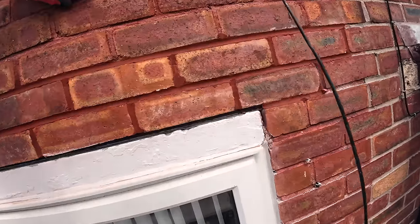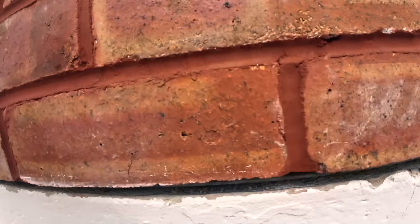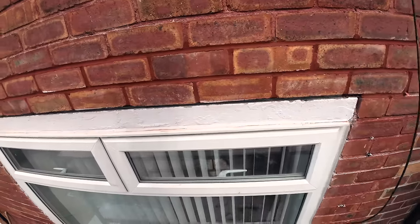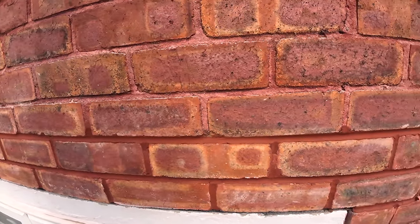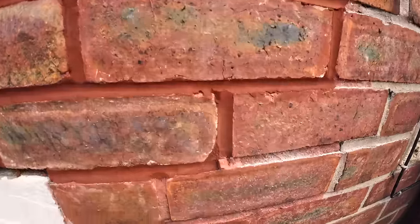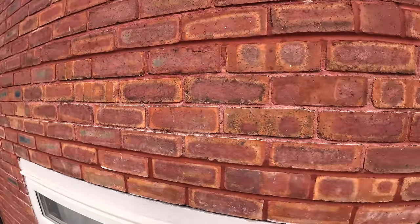Future-proof. You just see the damp course underneath, that's under the lintel. You can't see that from below though, so any water, if it does hit that tray, will come under the lintel and just weep out there. There's no vents in it. Can't put vents underneath the lintel. It's a different way of doing it, but it's the only way we could do it on this particular occasion. And we've got a vent at each end where the upstand is. That's a great job, that.